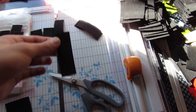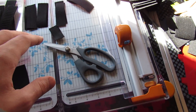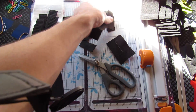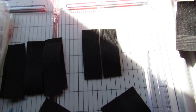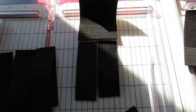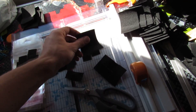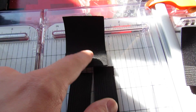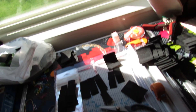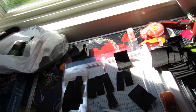This is for the hybrid — here's one strap, here's the second strap, and those are three inches long. If you put two of these together for the hybrid, they are actually thinner than the single wide strap of the dual — only a sixteenth of an inch different. That made us change the length of the horizontal strap: two and one-sixteenth inches for the duals, exactly two inches for the hybrid.